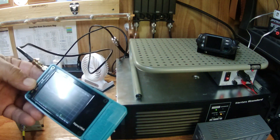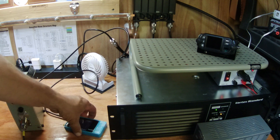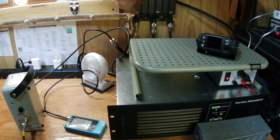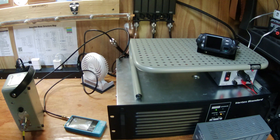The difference in our system is going to be strictly from the loss of power. Once that 40 watts gets dumped into this six-cavity duplexer, that's the amount of loss you have. So let's talk about the fixes for a minute.